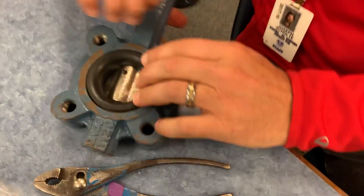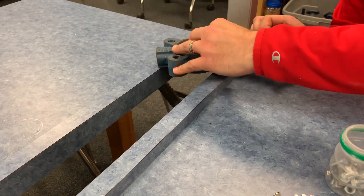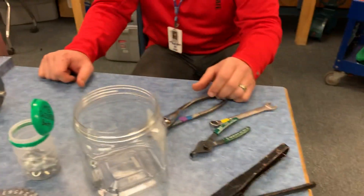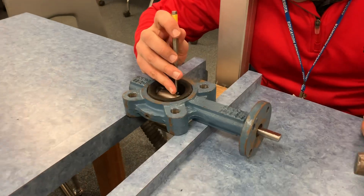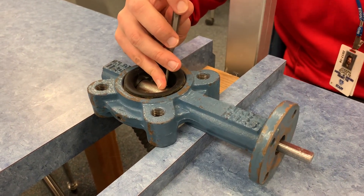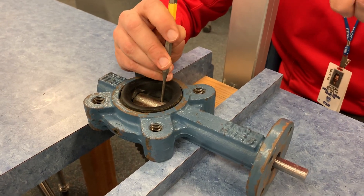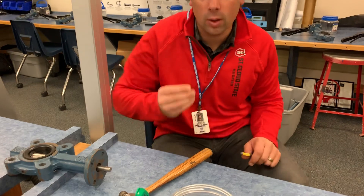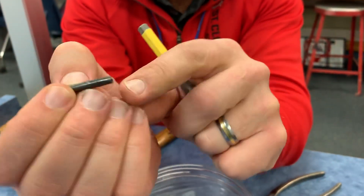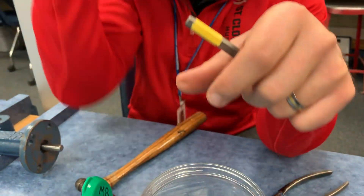Get it as vertical as possible and we are going to drive that roll pin out of this disc. We can't drive it into the table — we might have to gap something so the pin can come out. We need a hammer and a drift. Line up on the roll pin and hit it fairly hard to get it to move. We can see we're driving it close to flush, and then all the way out — it fell out. We don't want to lose it on the floor. This is a compressible roll pin — you can see this end has been permanently compressed, but it stays in place by friction. Drop that in our small container.